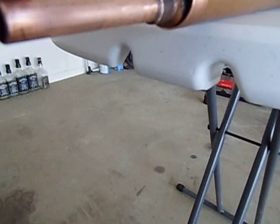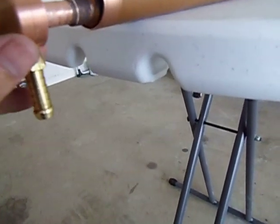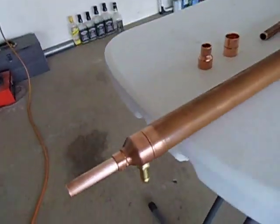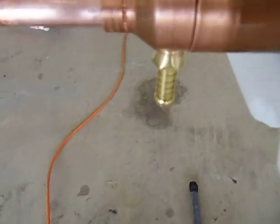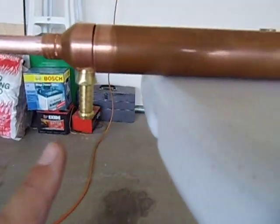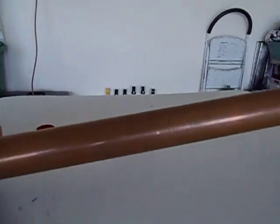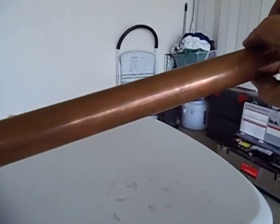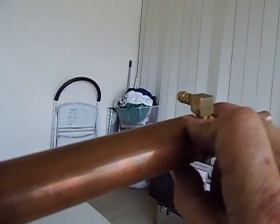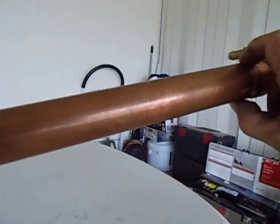That's going to be the pipe where the actual vapours go in, and this is where the water is going to go in. So it will just look like that — get welded onto there, just like that. The inlet hose will be attached onto this bottom one here. It will run up at a slight angle, and the outlet will be on the top end, so we've got no air pockets within the pipe.